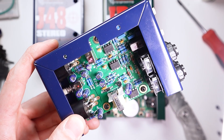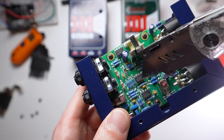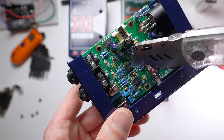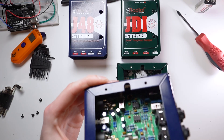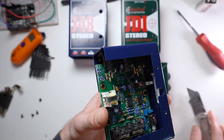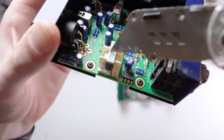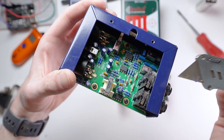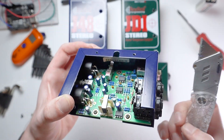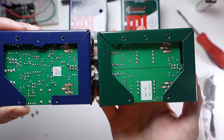However, the same cannot be said for the active DI. Upon first examination, we can already see there's a lot more going on here. The active DI uses operational amplifiers instead of transformers, specifically the TL072 op-amp. Radial claims these op-amps add minimal gain to the signal, however they maintain the signal quality and amplitude, so the passive DI will sound quieter due to losses in the passive circuitry. We also see a 7555 timer, which Radial is using in combination with capacitors to convert the 48V phantom power to a lower 15V for the op-amps. We also see a lot more resistors and capacitors than the passive circuitry, as well as a tiny transformer and a few diodes. The transformer is most likely for signal filtering of the phantom power in some way. And the diodes, I assume, are for reverse polarity protection, as well as rectification to convert the AC-like signal from the timer to DC, so the circuit can use it. I'll link to some videos that explain those concepts in more detail in the description.